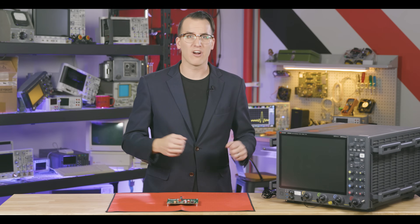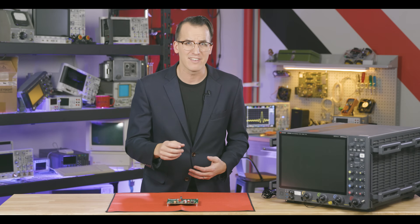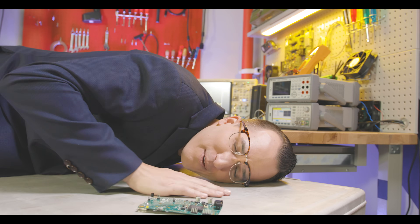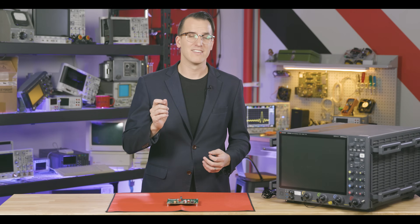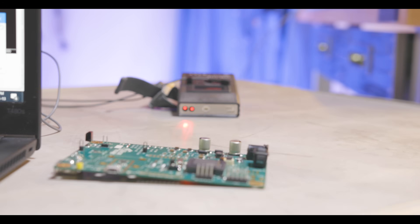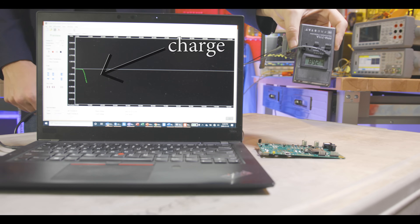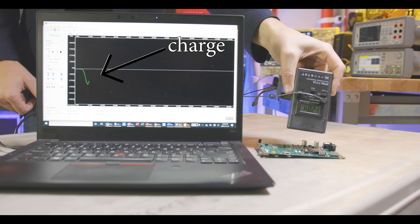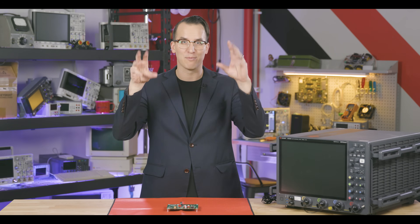But watch — if we jiggle the cart around a little bit, or just give it some positive reinforcement it so desperately needs — good job, cart — it charges up. In this case, it's charged up to well over 10kV. When you put your board on it, the charge equalizes and normalizes so they both end up charged thanks to induction. Your body can also charge up and transfer that charge to your board. Then you innocently go to hook up your charged device to your test gear, and boom!